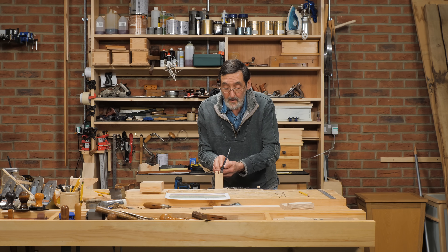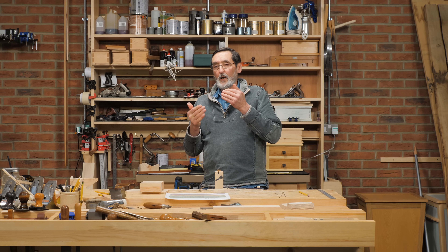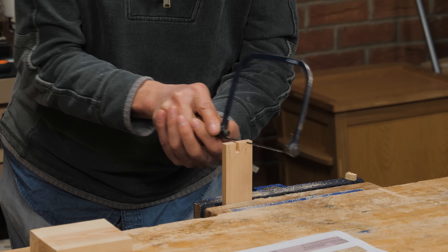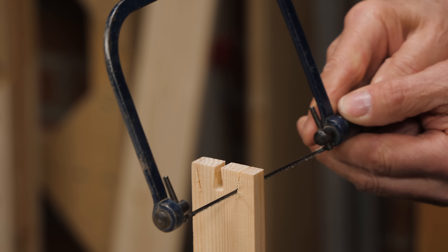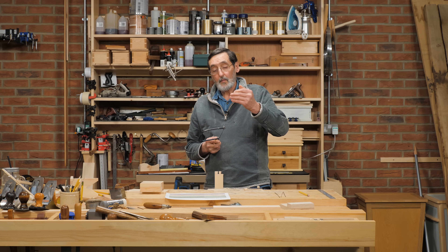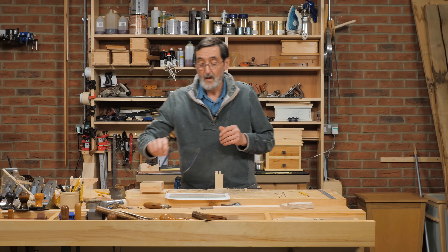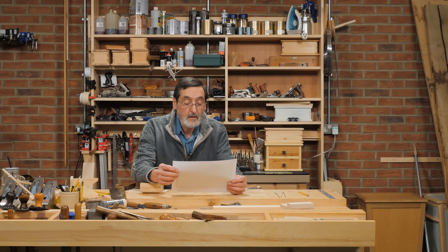It's always going to be on the cut stroke. If you're working on a push stroke, you make your turn every time you come around the corner — you start and push and turn, pushing and turning, not pull and turn. Because if you try on the pull stroke with a push stroke positioning of your teeth, it won't turn the corner — it will keep binding and actually bend the blade, causing a twist.